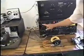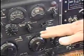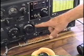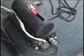Next, we see the transmitter servo. We're operating the ART-13 on local control. We'll switch from channel 4 to channel 5. You'll notice the switch to CW also. The red light is off. All the servos are driving down towards the zero position. Now they're driving up and looking for the presets. These three have found the presets. The DFO has found the presets. Now it's going into the lock position. The red light comes on, the dynamo motor is on, and the transmitter is operating.